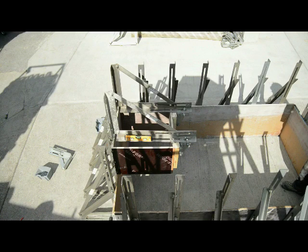So the next thing we're going to do, we'll take the plinth box back off, and we're going to simulate the concrete being already poured, and show you how you can lean the brackets back and then lift out the precast concrete unit. Because the brackets adjust forwards and backwards by quite a margin, which also allows for the uneven ground. It also allows you to use the system in situ for a precast unit.